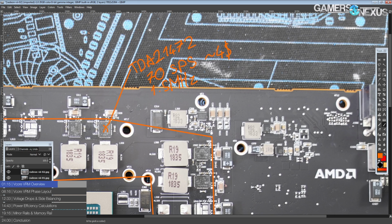But these also include something called body braking mode, which is a standard feature for International Rectifier power stages, which essentially is used for load transients on load release, which basically minimizes your voltage overshoot on load release, which is a really, really cool feature. But yeah, that's something the FDMF 3170s just straight up don't have.